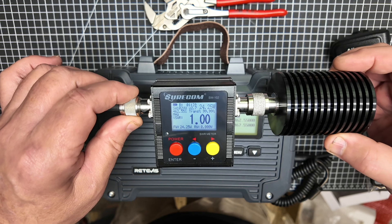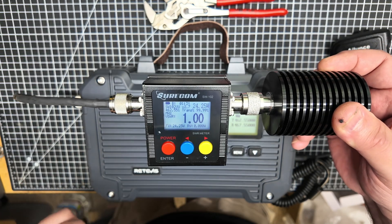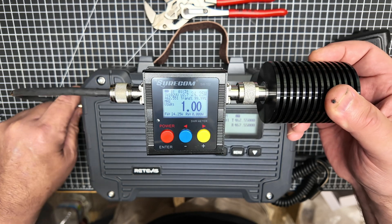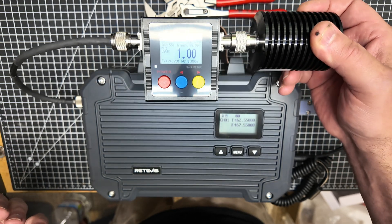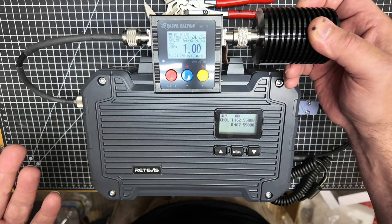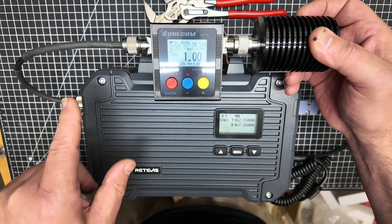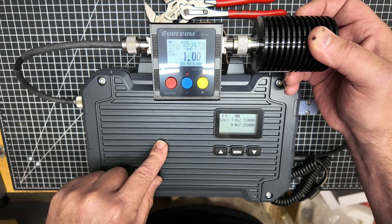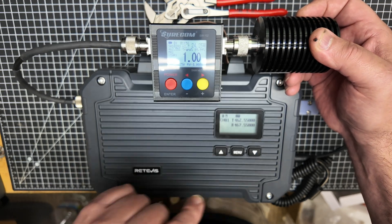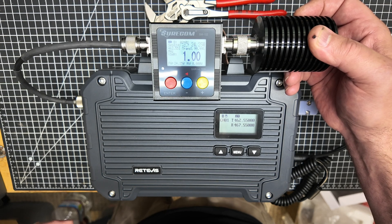Sure can. That is indicating 24 and a quarter watts out, which is pretty darn good — and that's just running it on AC power. The inlet power spec for this is 15 to 24 volts, so you could potentially get a little bit more power. And importantly, this is after the duplexer, which is where you generally have a lot of losses with repeaters like this. But this unit is actually getting the job done and pretty much meeting its rated output spec.